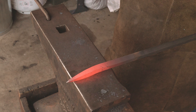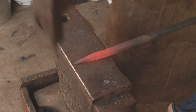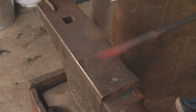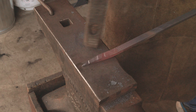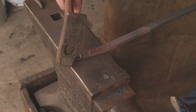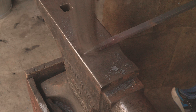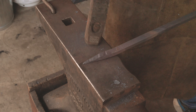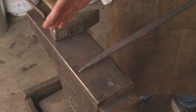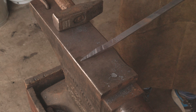We've got a little bit of a bend here. We'll put the bridge up and hammer that down. So let's say I had some uneven hammer blows — holding the hammer at an angle when you're bringing it down. If you see a series of hammer marks like that, you probably need to work on making sure that your hammer is coming straight down. I don't think I can fix that cold — let me heat it up and smooth that back out. We're getting pretty close to being done here. You can see how that stair step, the change in angle, has moved further back. I want to push that all the way back to my two inch mark.